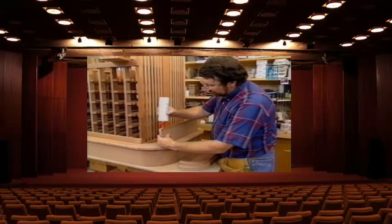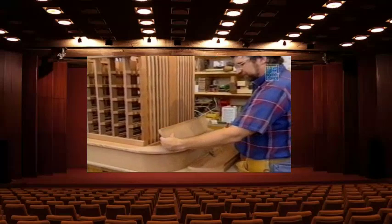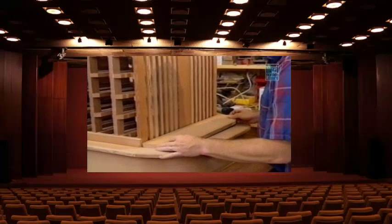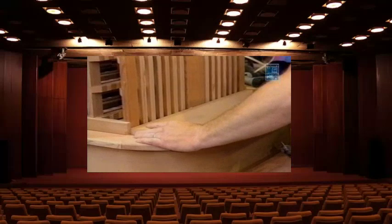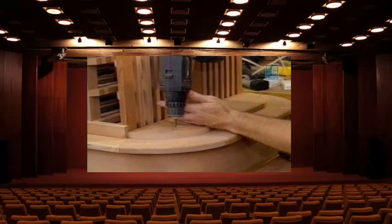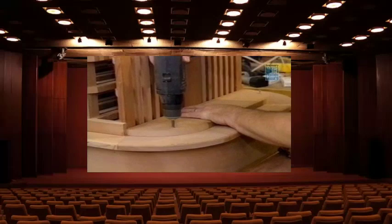The end shelves are pieces of one-by-six with rounded corners. I'm going to put a little bit of glue where it meets the slats at the back and a couple of screws into the base, because I want to be able to remove the base later while the shelves stay permanently fitted.